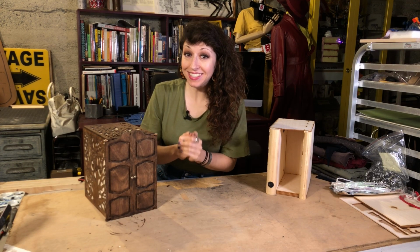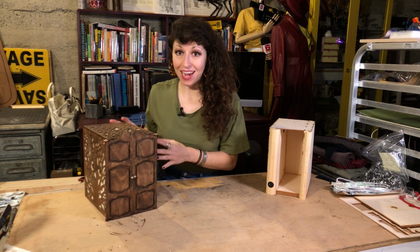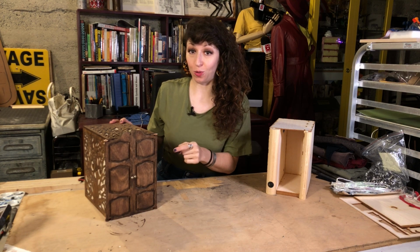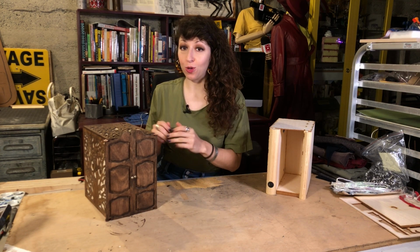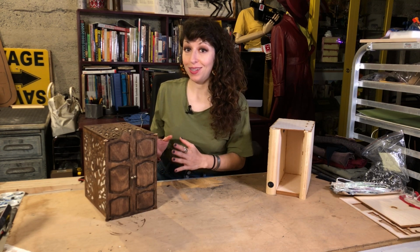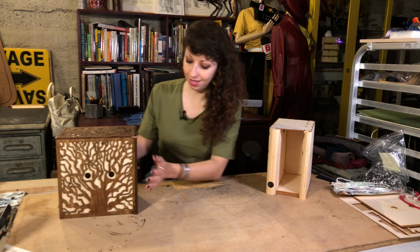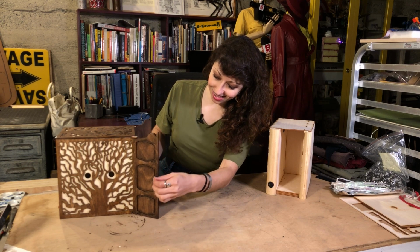This is it. This is the moment of truth. So I wired in all the LEDs, and there's a little micro limit switch at the front that's actuated by the doors. So when the book nook is closed, the lights should go off, and when the doors are opened, if I've wired everything correctly, the lights should come on. So let's see if it's working. Ready?